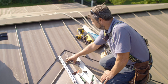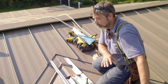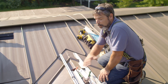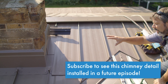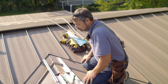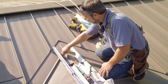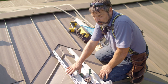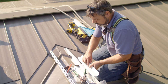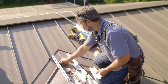This detail is highly at risk of leaking, so we're going to protect it as much as we can. Typically you'd want to do this aspect first — we chose to do this roof first mainly because of the amount of traffic we'd have in this area, and with the chimney we needed to get all that flashed in and finished. We're going to come in with our Z. I've lined this out already, and I'm using my level to facilitate how deep I have to cut my marks in here. We've measured over and marked out where we've got to cut out for our little water stop in the middle of our valleys.